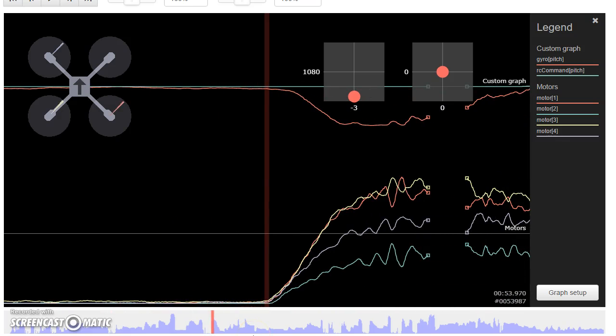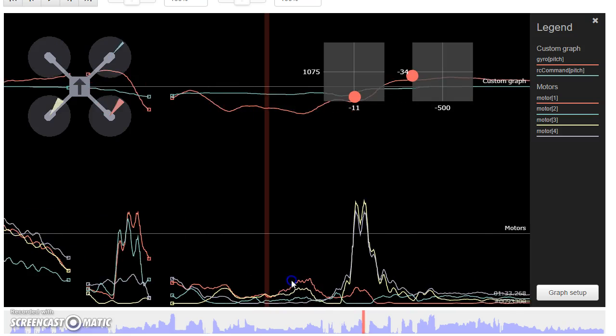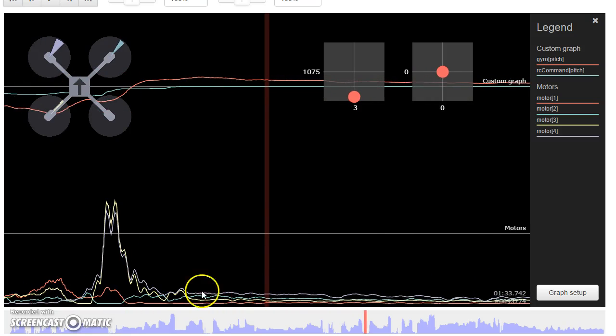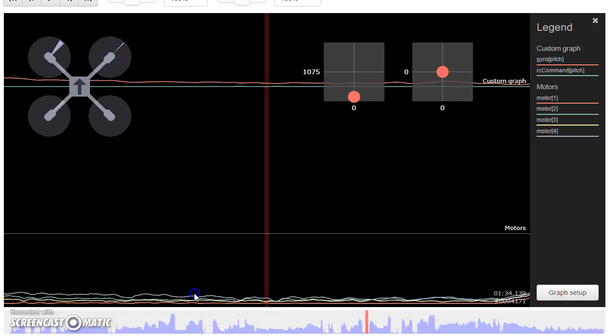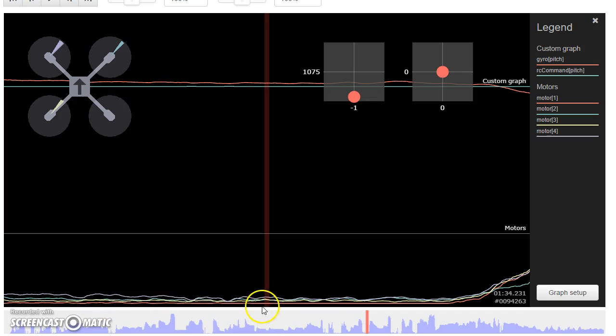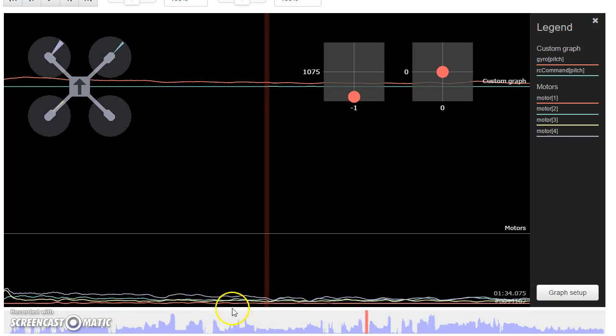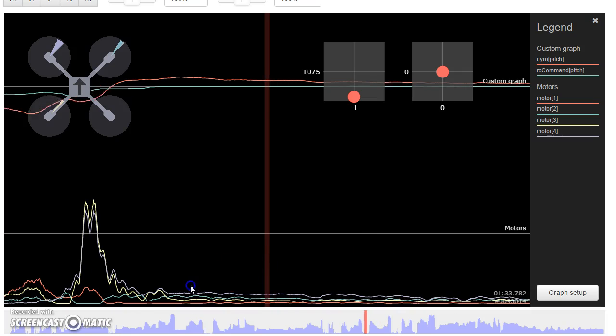And if we look at long no throttle drop with air mode on at 132. And there we go. Notice that the motors are more active. And that's probably the main thing that is, even the red motor, which almost gets shut down somewhere in here, is still kind of active. So it feels to me like that's probably contributing to the more locked in feeling that people are reporting.